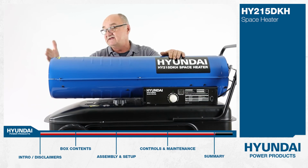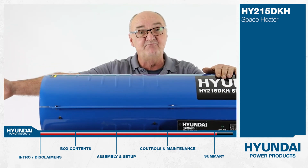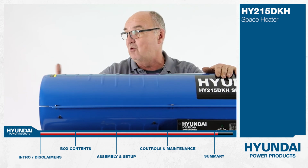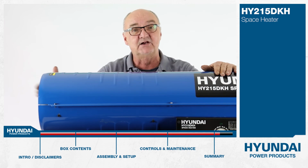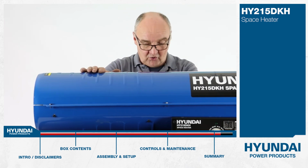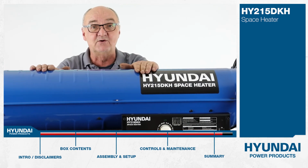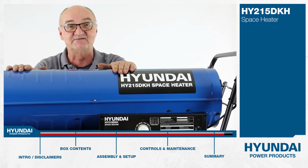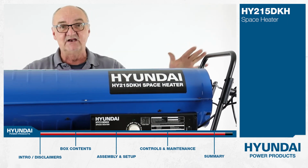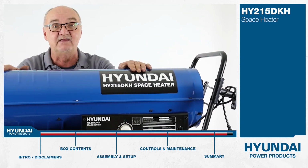So, recommended distances here on the hot end, 8 feet or 2.5 meters, 250 centimeters away from anything. Otherwise, it's going to get very hot on the surface of anything closer than that. Okay? All the other dimensions, the back, the front, the side and the top, we need to be 4 feet away or 1.25 meters, 125 centimeters. Just bear in mind, give it a little bit of room. 8 feet and 4 feet all around it, clear with nothing in the way.